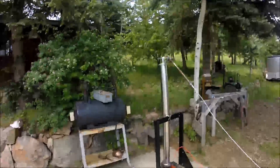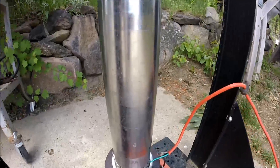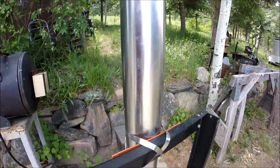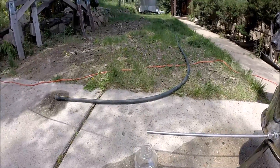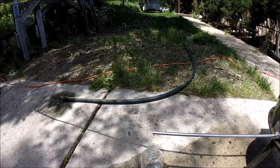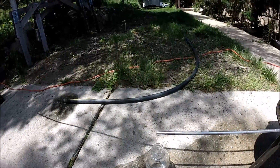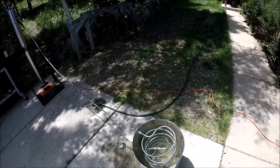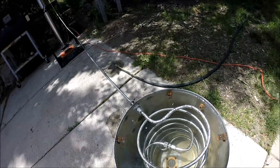The tube is working — it sounds like it's bubbling in there. The whole column is heating up nicely. At the outlet there's some water coming out, which wasn't happening before, so I'm almost certain this is producing distilled water — with the exception of not having cleaned any of this beforehand, so I wouldn't drink it. We're going to test the pH afterwards. Hot water is definitely coming into the condenser coils because you can see bubbles forming.